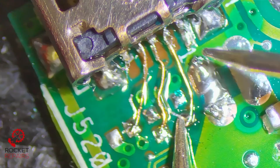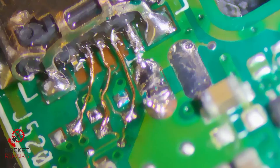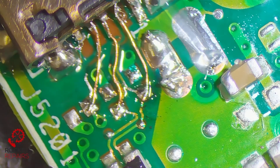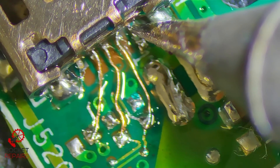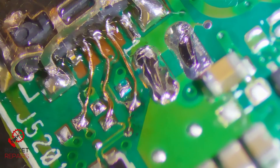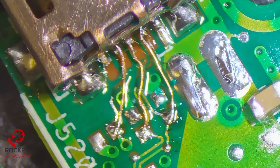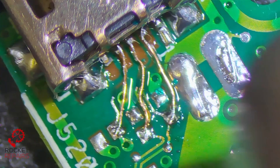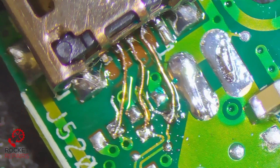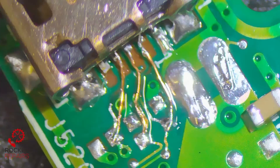And here — just to make sure it doesn't touch here. Doesn't touch here. We'll touch here but it won't touch here. Good. And touches here. Good. And it's stable. Yep. And then this is still solder, which is perfect. On the right hand side — do I need to put any more solder? I think that's good to be honest, that looks relatively strong. I will tap it — just want to make sure that this isn't going anywhere. Make sure that pin is down — it is now. Good. None of it looks touching. Perfect. Now we take our brush, we're going to heat the area up and give it some IPA. You can see the flux all melting. Now coming in with IPA on the brush and just swiping down. If any of these break, they are not strong enough.